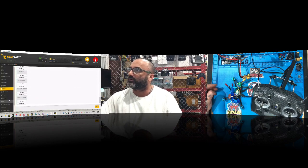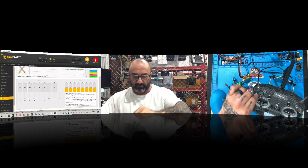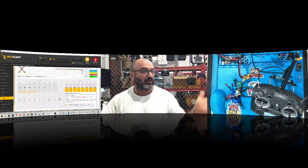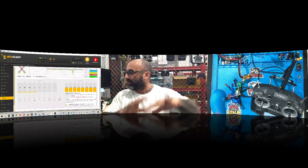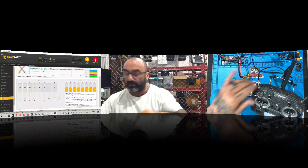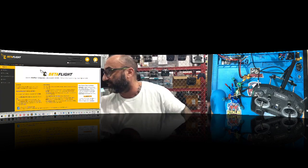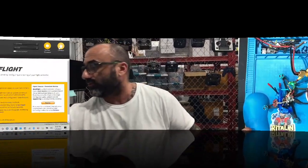To show that you've done it right, you saw everything moving, so you know you've got communication. Next, come over to motors, turn that on, and arm it. If the motors are spinning like they are now, you know it's working — everything's good. The customer can see it's working and fine; now it's on them to set it up for their radio, but you've done your job properly. Power everything off and that's the end of it.